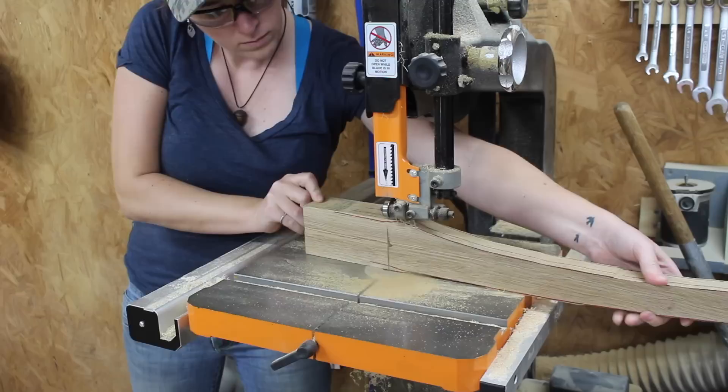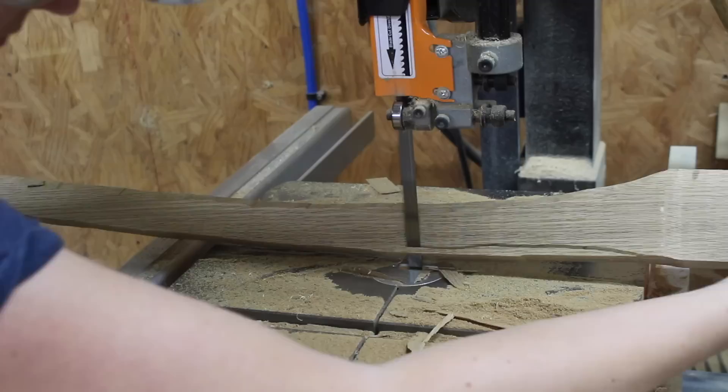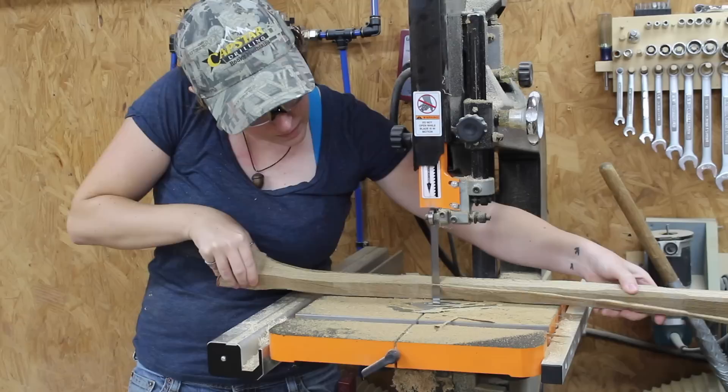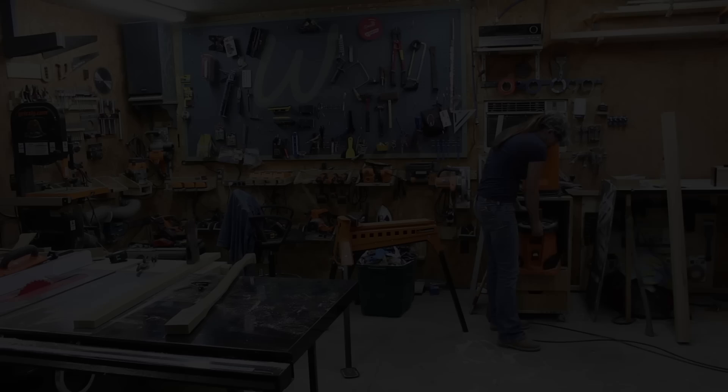At this point the handle was just very roughed in, so it was time to start shaping it and cut down on how much material there was to remove. I ran each corner through the bandsaw, almost cutting in a chamfer — essentially just taking off the corner. I will admit doing this on the bandsaw was a little difficult and did take some practice. If you have a spokeshave or a draw knife, those tools would probably be a much safer route to go.